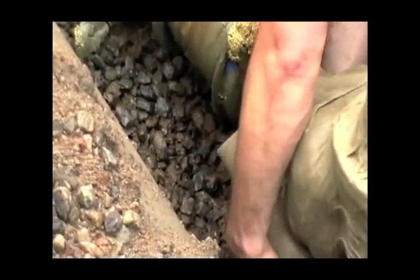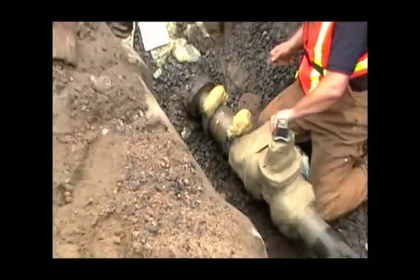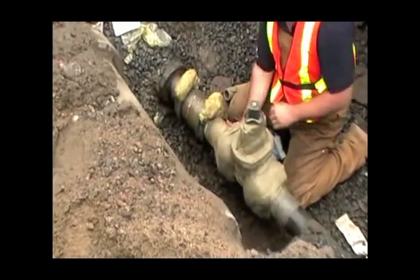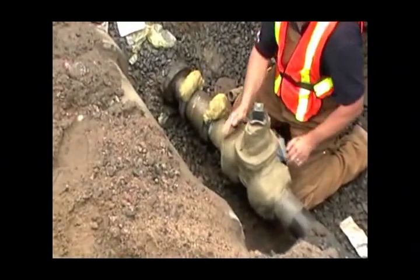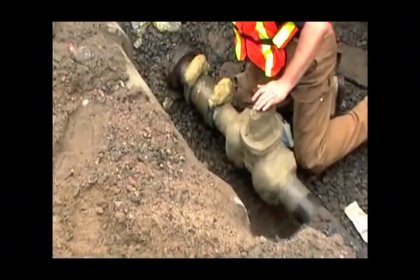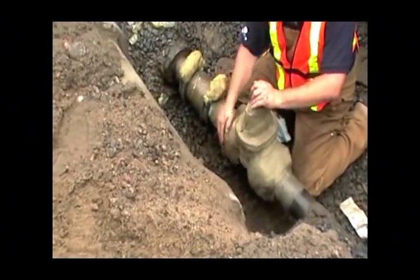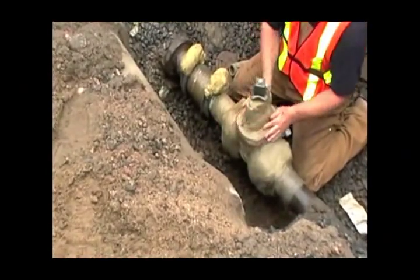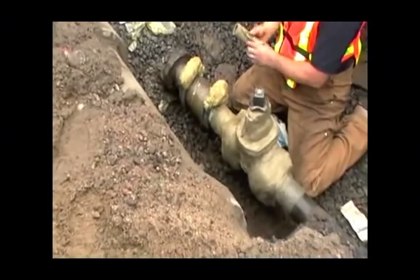I'm just going to seal this up with the PVC because, like I say, we usually come down 4 to 6 inches on the other side. You can see how well that just seats down to itself, even with the wrinkles. It's smoothed out. Some folks, say they're wearing gloves, if their hand's sticking to the material, will take a bit of that paste to rub over it. It's not mandatory. It just sometimes allows the gloved hand to slide over and seal those seams up a little easier. That's all it is.